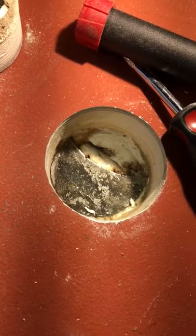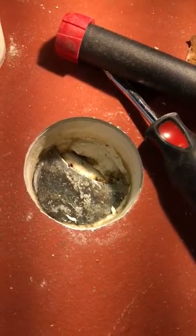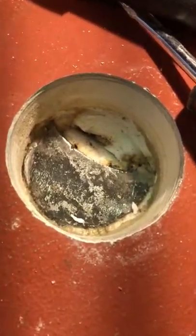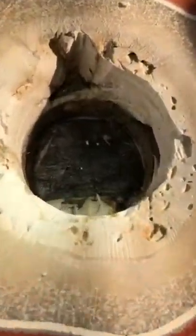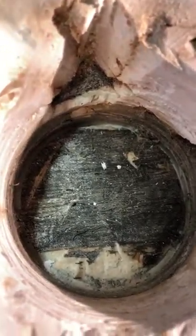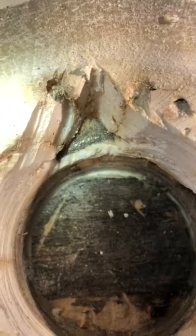Here's the uppermost hole that I've drilled — it's about two feet up, a little more than midway, and you can see the lightning hole. The steel looks like it's in quite good shape. There are a number of spots where I can see water has been working its way up — you can see this little crack that let water up into the rudder. Even midway up, this plywood was damp to the touch, but the steel around it looks quite good. There's a piece of steel on the outer edge of that plate — I can see the thick bit.